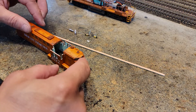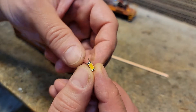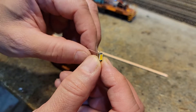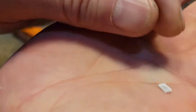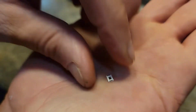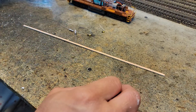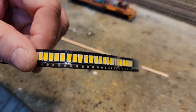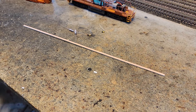I'm going to put in the lenses, then put a flat panel — this is a surface mount device light. I have one wired up. The trick with these things: that's what they look like on the front, that's what they look like on the back. Normally they're supposed to be marked for which one is plus and which is minus, but a lot of them come in rolls and are not marked. So you have to test it and figure out how it works.